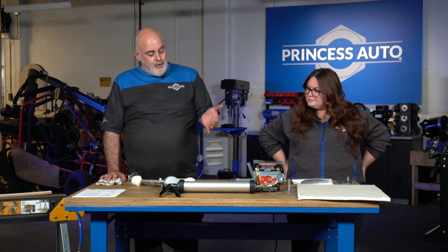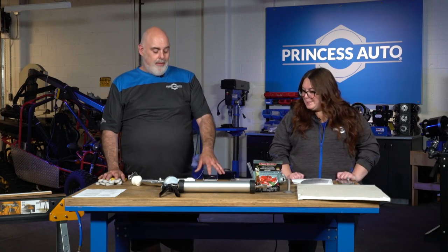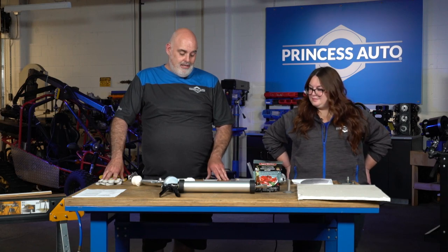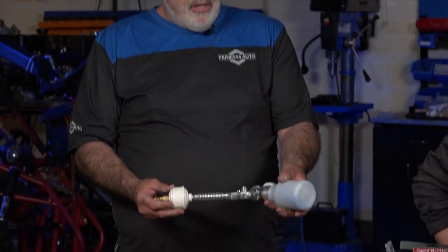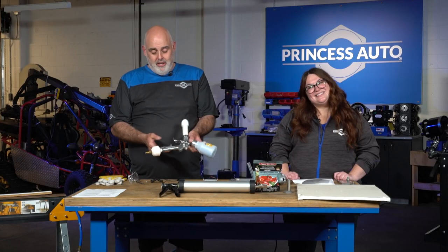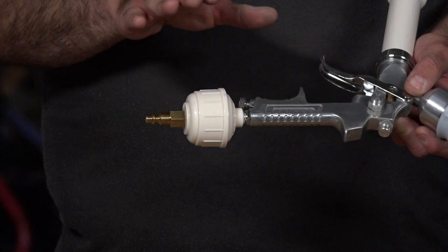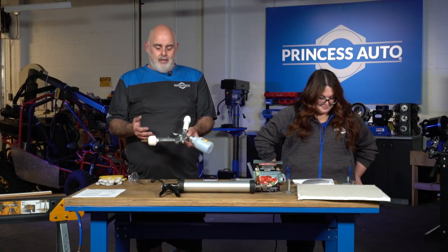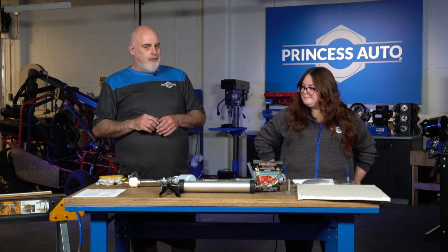We've got a bracket here — it's a trailer U-bolt bracket, raw steel. I wiped it down with a little bit of lacquer thinner and we're going to give it a quick coat. I do have a part that's been cured previously that we'll show you after. It uses air pressure and static electricity. The gun sends out powder; as the powder exits the end it produces a positive charge, and the negative ground strap hooks up to the part, holding the powder on until it's cured and baked in an oven.